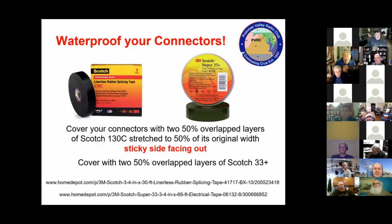I prefer Scotch 133 to some of the other rubber tape, and the reason is that it's linerless. Some of the other competing brands have a liner that you must discard, and it's just a pain in the neck up on a tower to be fooling around, not only with the tape, but with this liner that's coming out. So I prefer the linerless tape. It's readily available. It's not terribly expensive. Both the Scotch 133 and the Scotch 33 are overlapped at least 50%.